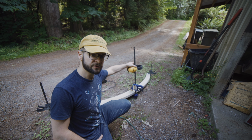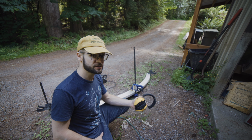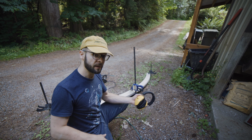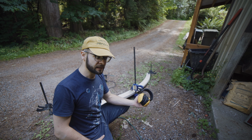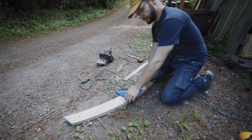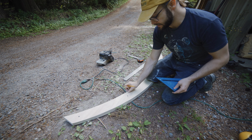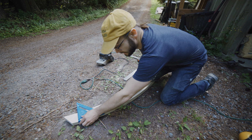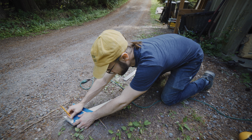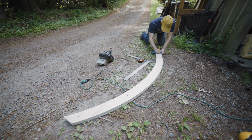The next step is to do cutouts along the length of these inner beam segments that I've just made. While they're still screwed together, I'm going to draw those out, route them out, and then we can get to assembling the I-beams. The first thing I'm going to do to create these shapes is trace the length of the entirety of this at an even distance from the edge, so that there is a minimum width from which the holes can be cut. I think I'm just going to go for an inch basically the whole length in from either side.